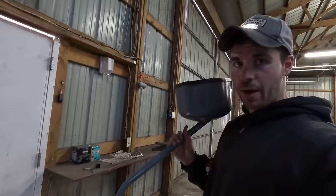That's nice, and then you just let it sit there for now, while you're changing everything else. You haven't pulled the old filter off? No, because that's what I'm needing you for. One. Go. There you go. You're good. Now you slide back. There we go. Okay, we got it ready to go now. Let's see how hard this thing starts. See how good a job we did bleeding the system.